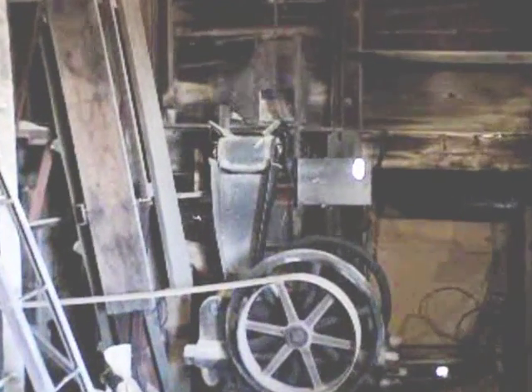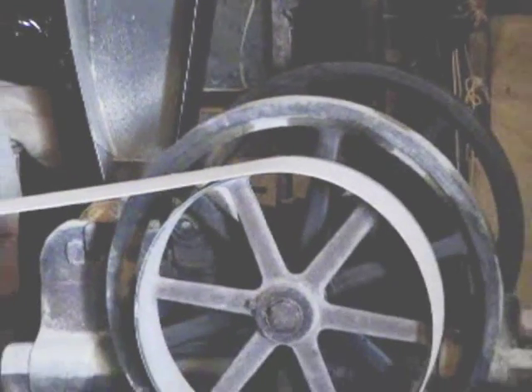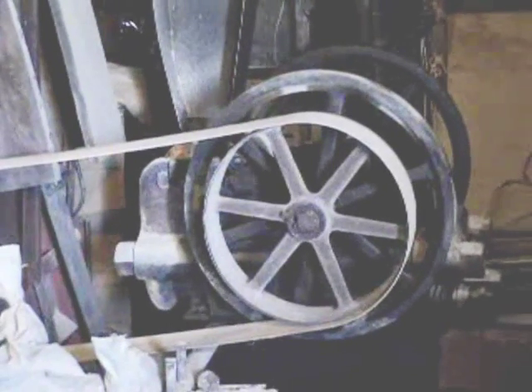What the miners would do here at the Comstock Gold Mill is bring the ore down to the Arizona Comstock building here in front of us. That's a bin there. The ore would fill that building, and it would come out of the steel door right here. They would open that door, the ore would come onto the conveyor belt, then it would drop down into our first set of wheels here, which is a primary jaw crusher. The jaw crusher had two jaws inside that moved back and forth, and it would crush the bigger pieces of ore down to smaller pieces.